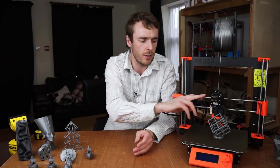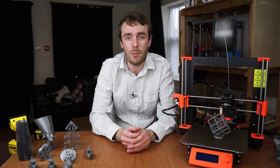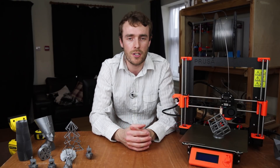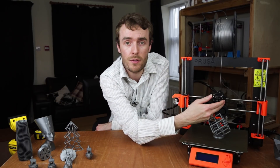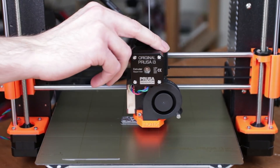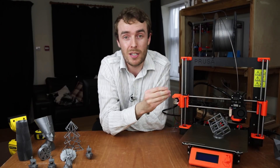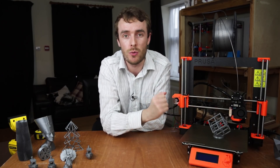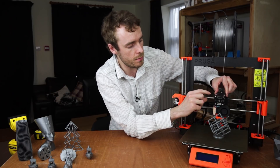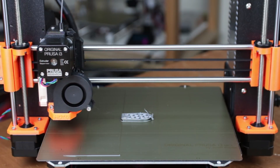So you just push the carriage and it'll detect a skipped step, right? Well unfortunately it's not that simple. As far as I understand about the Trinamic StallGuard technology, it only senses a skipped step if the unwanted force is in the opposing direction. As the carriage is moving to the left you need a force to the right — if you apply a force to the right as it's moving to the right it may skip a step but it won't be detected because it's not resisting the motion, it's adding to it. So the best way to test it is not to push the carriage but let it push you — as it moves toward you, put your fingers in the way and let it hit them. Don't do this on a printer that doesn't have StallGuard because it will just push your fingers out of the way.